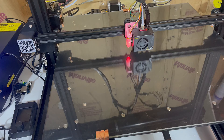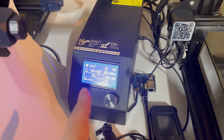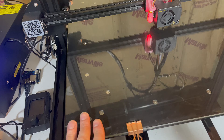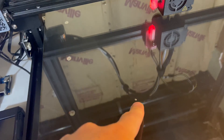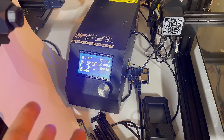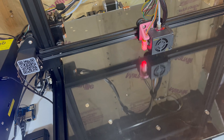I've configured the bed mesh to start. However, I need to heat the bed up — right now I have it to 45. If I try to put it to 60, it would take 45 minutes to heat up this bed, and even then the outer edges would still be relatively cold. That's because underneath there's actually a very limited range of the heating element — it literally only goes to about right here where you see these screws. So there's no point putting it higher. Now it's almost there; it's been about five minutes. I'm assuming I have to wait five more minutes, but then I'll start the bed level and then we'll do our first test print.